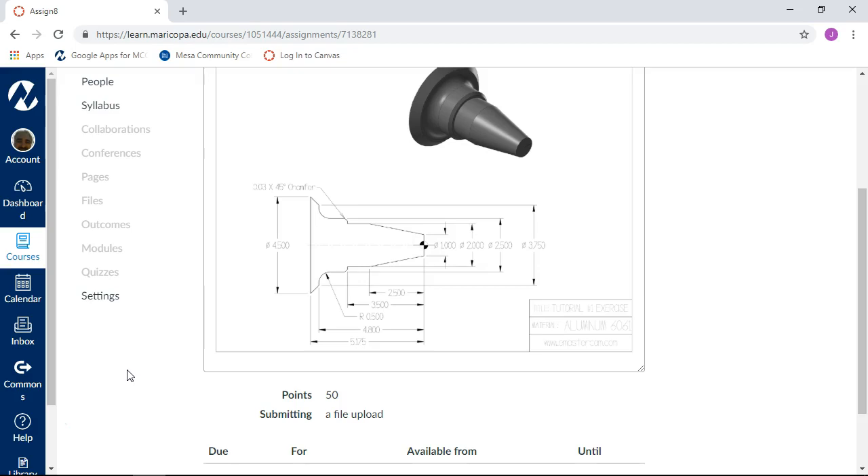So if we say this is a 6 inch chunk of material, that's pretty close, but it also sets me up to where I can either hold on to this diameter, and if I bring it up against the jaws that would act as a stop, I could face off the back side. Even though that's a lot of cutting, taking that inch of material, with right tool geometry I should be able to take it in maybe three or four passes being really aggressive, or five or six if I want to be a little gentler.